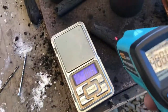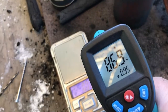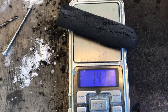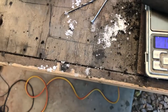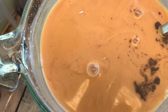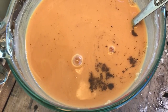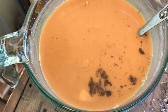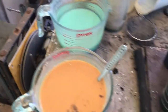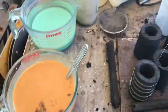Okay, I got the electrode out of the oven. It's not that hot. I'll put it this way, I can pick it up and it's bearable. So it's weighing in at 14.3 grams. So submerge. Okay, so that should be sucking up some of that zinc hexacyanoferrate nanoparticles with a bit of luck. So I'll do that 3 more times. Then I'll do it in nickel hydroxide, and then I'll wrap the wire around it once it's dried again. Electroplate that one and get a test going.